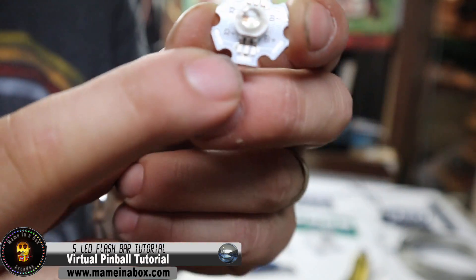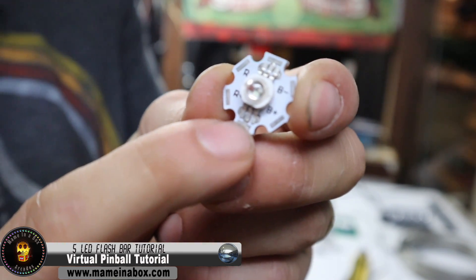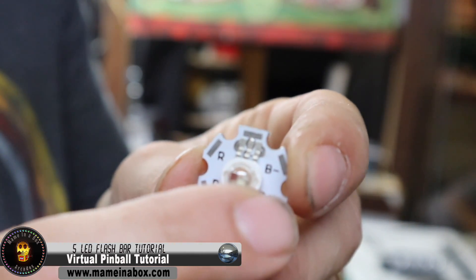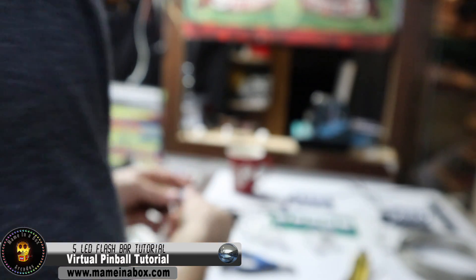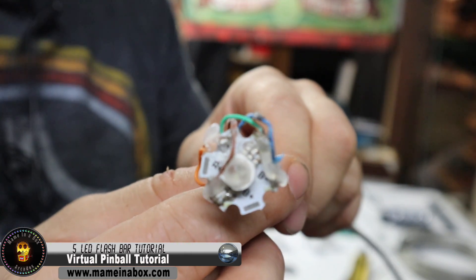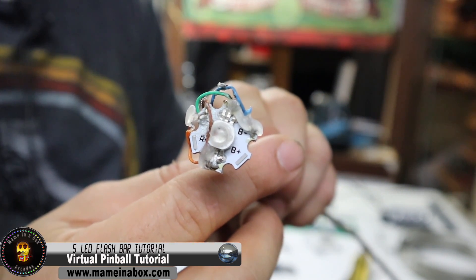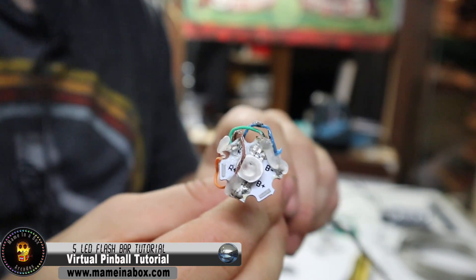At the bottom we're going to use solder — cover all three pins and extend the solder to the little pad to provide power to all three RGB channels. R is for red, the top right is green, and B-minus is blue. You solder your wires from the RJ45 cable onto the board. Then I like to add a bit of hot glue on top as an extra precaution so the wire doesn't unsolder. I've never had an issue, but I like to do it. So we have four wires on here.